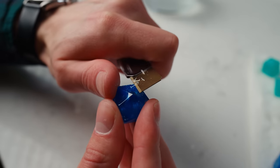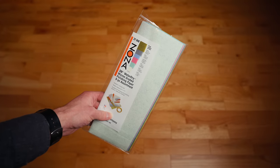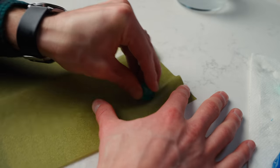Now onto sanding and polishing. First, carefully clean up the edges using a utility knife, working along the edge keeping the blade at the same angle as the face. Then move on to sanding — most people recommend Zona Papers, which is what I got and they've been great. I usually only need to do the top face, and sometimes the face next to it, particularly on the D20. I've been following Rybonator's advice — an excellent YouTube channel. Dip the dice in water and go up and down 10 times, left and right 10 times, and in a circle 10 times. On the two finest grit levels, repeat this three times for extra polish. I've linked Rybonator's channel and all other helpful resources in the description.